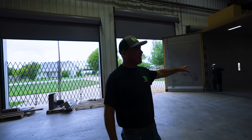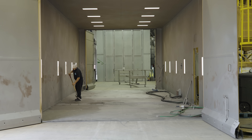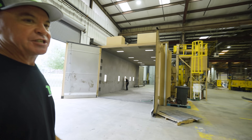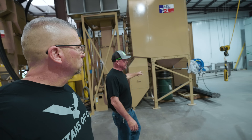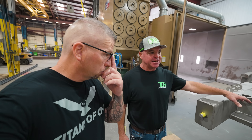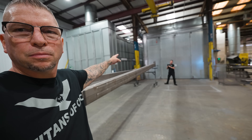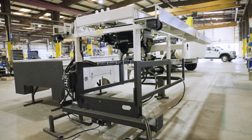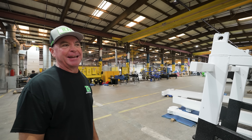All of our components go into the blast booth. We use 80-grit steel shot media. It goes down into the pit, augers up, recycles, cleans, and reuses — making us more efficient. It's basically a sandblasting booth, but instead of sand we're using steel shot. Once units come out of the blast booth we're down to bare metal with all the mill scale off. We seam-seal all spots that aren't welded so there's no rust bleeding through. Then we've got two big commercial paint rooms. When stuff comes out you can see how shiny and beautiful it is — there's a lot more that goes into painting than most people think.